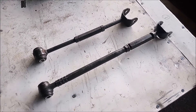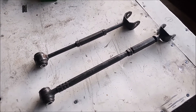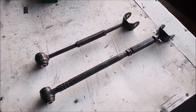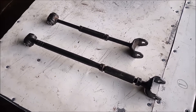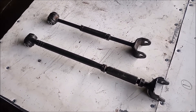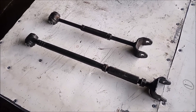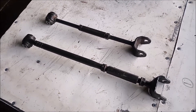I don't want to get into the whys and wherefores of Toyota making this change — hint: snap oversteer. The fact is that the longer tie rod reduces the bump steer. Bump steer on the rear wheels? Yes. Bump steer on the rear wheels. Get over it.